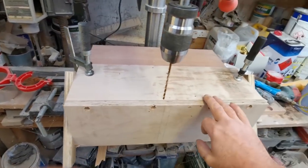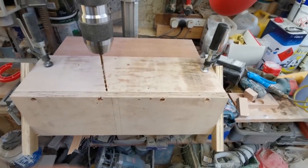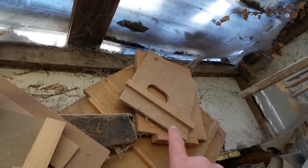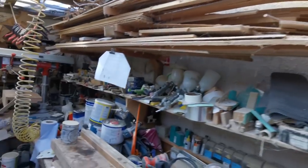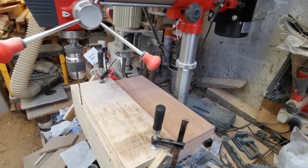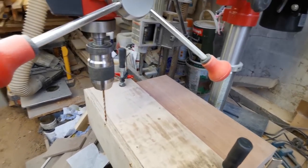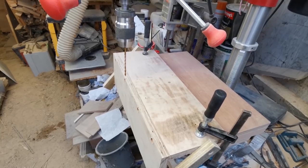It's a bit rough, but like a lot of my jigs, they work — they do this job. I'm not too bothered about keeping them; some I made five years ago and some are older. There's a good chance when I can't use them again they'll be useless. So when I make a jig, I make it work, I make it accurate, because every cut you make with that jig is going to be repetitive — it's going to repeat any mistakes you put in it. So make it accurate to begin with, but just make it as a utensil to help you get that job done.